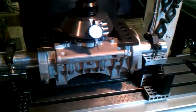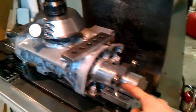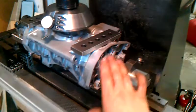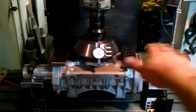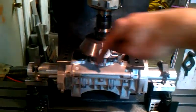I can explain now finally why we're doing this. I made a mandrel here on the lathe — this shaft going through the engine cases is exactly the size of the crankshaft journals. I have the case torqued down on this mandrel, the mandrel set up dead flat with the travel of the mill, and the fly cutter trammed in a circle also dead flat to the mandrel.